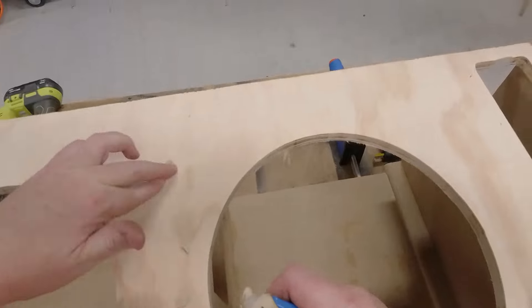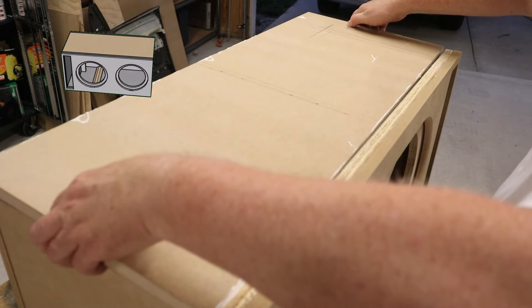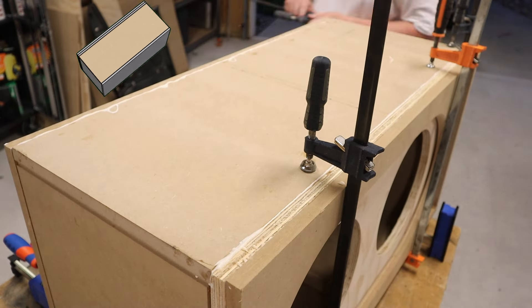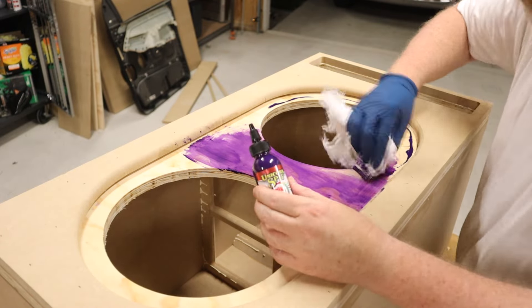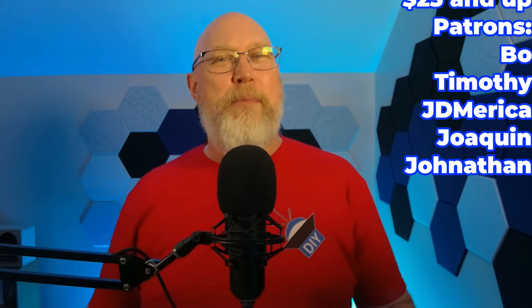After tacking down that inner baffle you can fill in the nail holes with some wood putty and sand everything smooth. I attached the outer baffle off camera and now I'm installing the top — this is often a really tight fit and again the clamps come in handy to force things into place. The box is assembled but not finished. The plan is to carpet the box and then stain that inner baffle with some Unicorn Spit, which comes in some really bright eye-catching colors — to make a bright eye-catching design with high contrast between the carpet and the stain on the plywood. If you want to see that, hit the subscribe button and ring the bell so you don't miss the video. A big thanks to all my patrons and channel members, and an extra shout-out to 25-and-up patrons Timothy, Jonathan, JD, America, and Joaquin.